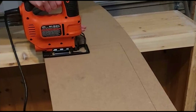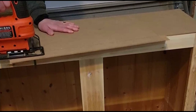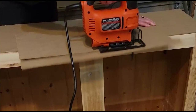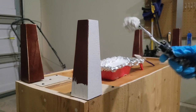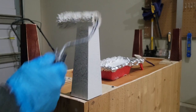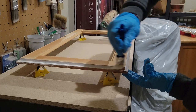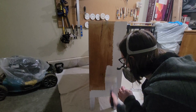You should always scuff sand prior to painting — just extra insurance to make sure your finish is going to last for years to come. Since the jigsaw doesn't give the greatest cut, I did just sand down the edges with my sander. We're finally at prime time — I feel like it took forever to get to this point, but finally here. I did scuff sand the legs as well. When you're doing the doors, you really want to do light coats. On any piece, do light coats, but the doors especially — you can get a lot of drips. Never try to get full coverage on the first go around. Always wear a respirator; this stuff is quite smelly as well.